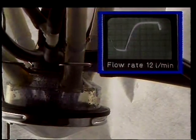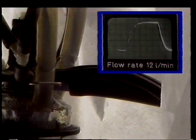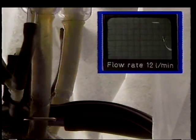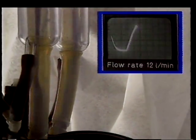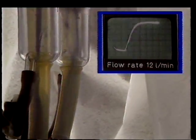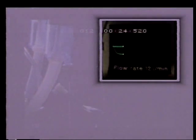The Harmony liner is connected directly to the Harmony claw without any nipple. The liquid flow is extremely high, 12 kilograms per minute. The liquid flows smoothly through the short milk tube and can be observed on this horizontal line during a pulsation cycle. No teat wash can be observed in the liner or on the diagram.